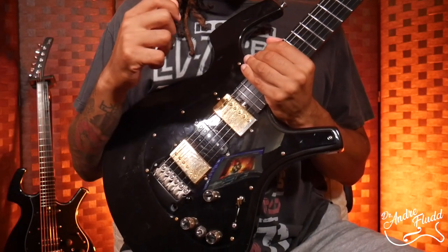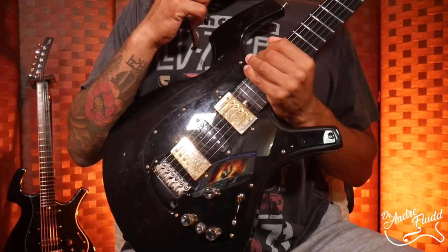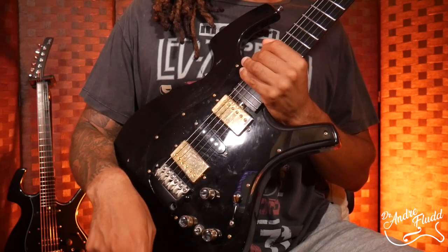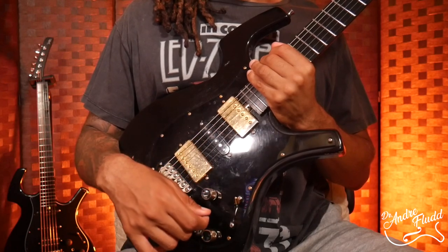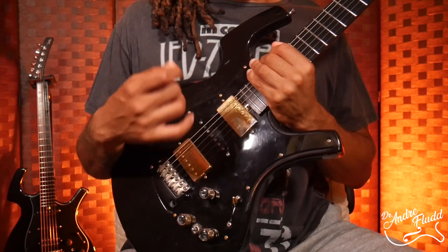Of course, Parker Nitefly, and I have Seymour Duncan humbucker pickups, and then I have a single coil in the middle. The first issue I have with this guitar is that although I can split the humbucking pickups to single coils and the tone sounds nice, there's so much hum, it is basically unusable. So there's too much hum in the neck, too much hum in the bridge when they're split, can't use them,